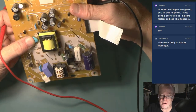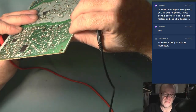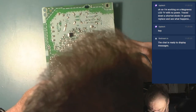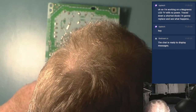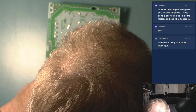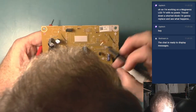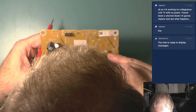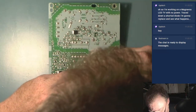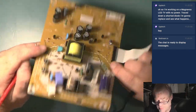There's the wire. I'm pretty sure this is not a multi-layer board. So what is this shorting right here? R672A. Okay, which is... Oh, never mind. It's this piece of wire again. Ah, that's driving me nuts. There's got to be something shorted in this power supply.